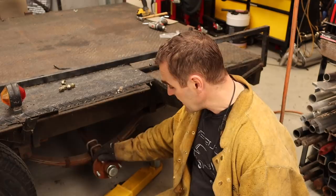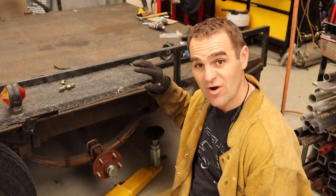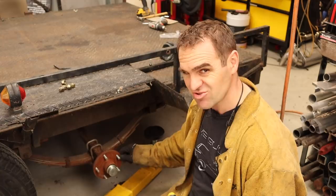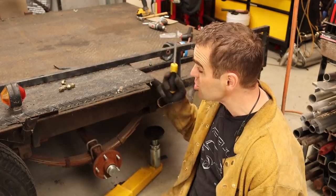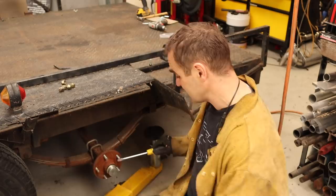While I'm here, after the debacle last time I tried to use this trailer, I realized one of the wheel bearings was completely demolished. This one is spinning nicely and there's not a lot of play, but it sounds dry. So I'm going to go around and double check the wheel bearings. Those who haven't played with wheel bearings — pop the top and yeah, this looks very, very dry.